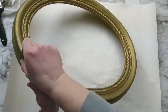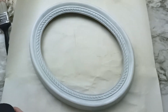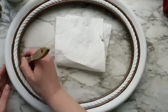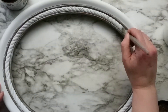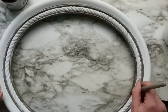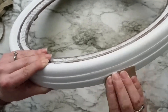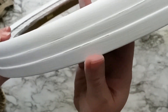For the frame, I sanded it down so the paint would stick better and gave it a coat of Slick Stick and then two coats of Rust-Oleum chalk paint in linen white. I wanted the frame to tie into the mirror so I took the bronze paint again and added it to the raised section bordering that twist detail. Then to distress this area, I took a chippy brush with my white paint to go over the bronze, using a very tiny bit of paint on my brush. I did the same thing with the bronze paint and dry brushed it over the twist detail — I think this looks so beautiful and ties the two pieces together. I don't like a lot of distressing but I thought this piece needed it, so I took some sandpaper and very lightly distressed the outside frame detail. Distressing is such a personal preference — if you like a heavy distress, by all means take off even more paint.